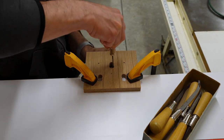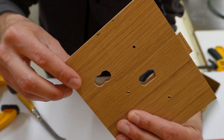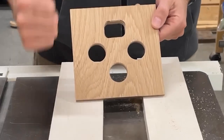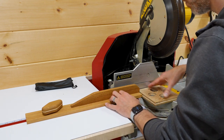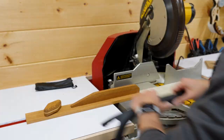I used a few rasps to remove the high points left by the drill bits and turned the adjacent holes into slots. Then I rounded over the edges with an eighth inch bit and started working on the more traditional pieces of the box. I made the bottom of the box out of a scrap piece of quarter inch plywood left over from our hallway art project. And instead of taking measurements, I used the top of the box as a gauge to cut a same-sized bottom.